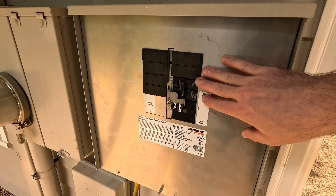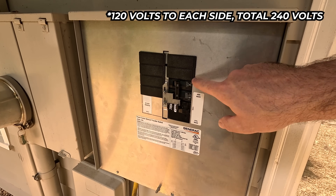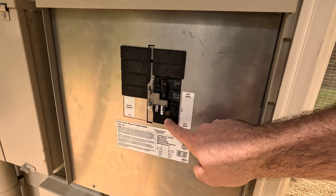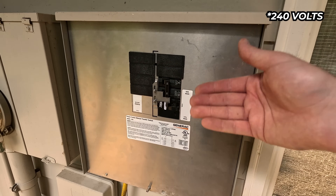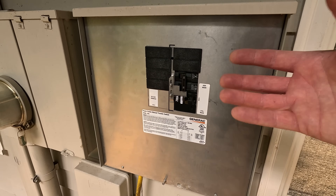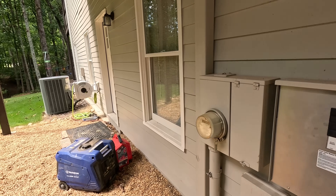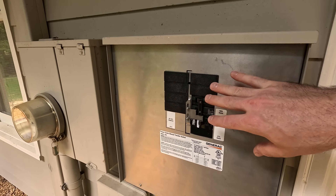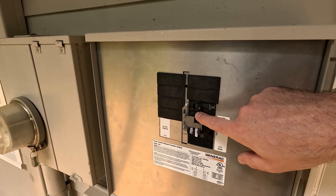There are all sorts of different varieties of transfer switches. This one is a 30 amp and can supply 240 volts to both legs of the service inside. My house has 200 amp service, so how are we going to feed in 30 amp power and make up for that big difference? We're not even doing 240 volts — we're taking 120 and feeding it to both sides of the transfer switch. This is just for emergencies; the goal is not to power everything like a four-ton air conditioner, just the essentials — refrigerator, freezer, basic lights and electronics — and for that, 30 amp power is all we need.